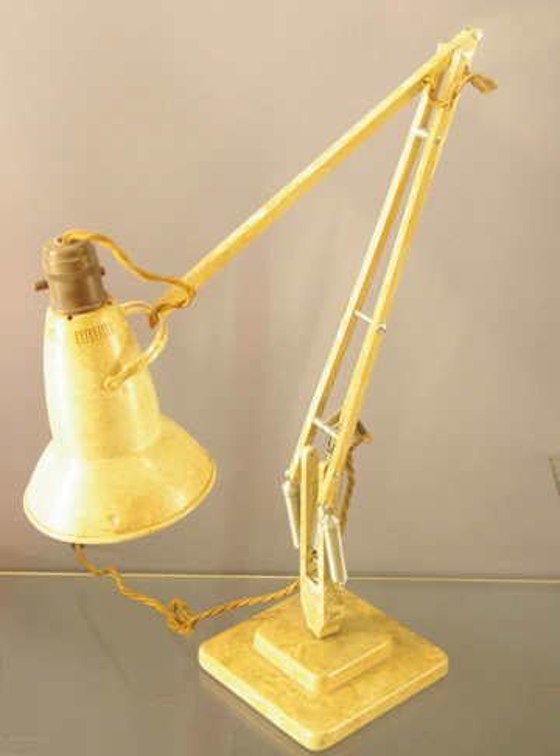The lamp cap rotates the same direction as the upper arm and forearm. One tension spring set controls the forearm, which is a parallelogram having two bars. A stronger spring set controls the upper arm, which has three parallel bars. There is a less stable construction with two parallel bars in the upper arm, which is less expensive to manufacture due to the parallel linkage of the lamp. The lamp cap keeps pointing in the same vertical direction when adjusting the height. As with most balanced arm lamps, the whole assembly can rotate in the horizontal plane, and is mounted on a stable foot.